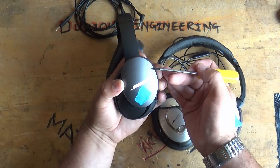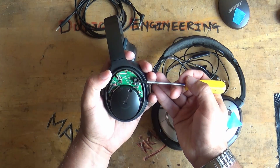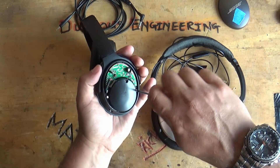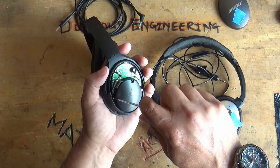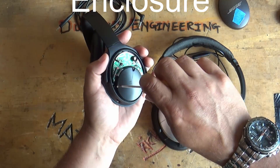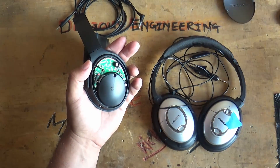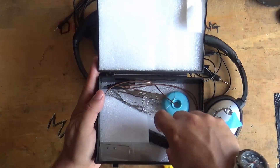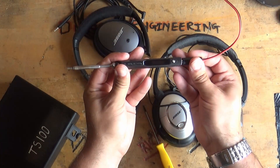What I'm pointing to here is a little slot where the microphone is located — you can see it. That microphone listens outside the headphones. They use fantastic technology to reduce ambient noise: an outside-facing microphone listens to the noise outside and plays a small amount of that noise back in with the waveform phase-shifted by about 180 degrees.